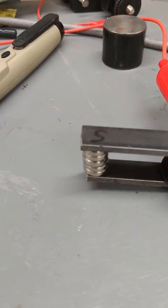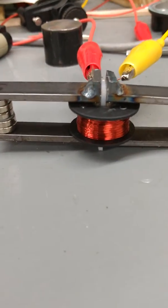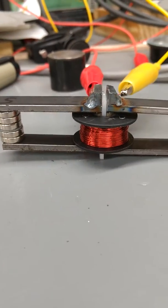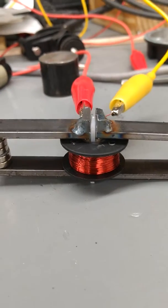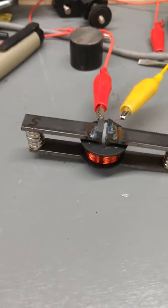I've got Neos on this end stacked south up, Neos on that end stacked north up, sharing a single coil, a split Alnico — you can see it inside the coil there — with a piece of plastic to maintain air gap so we don't join the two circuits.